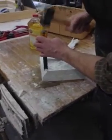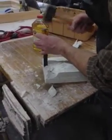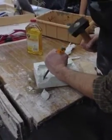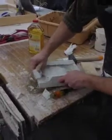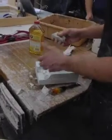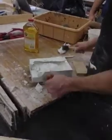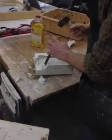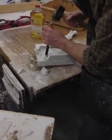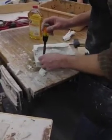Straight down. And the plaster will break where it wants to break. You can motivate it in certain ways, but eventually it'll snap where it needs to snap. Now, here we go, we have that surface there. If you did a good release, it will break along that seam between new and old plaster. So what we want to do is just straight down, nibble off some of these pieces. What I do is tap it until it snaps, and then I stop tapping. Simple as that, right? It'll snap, and then you can wiggle it or slide it off.